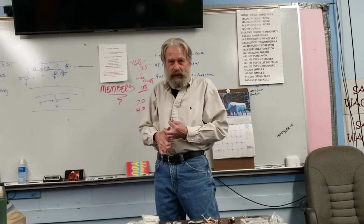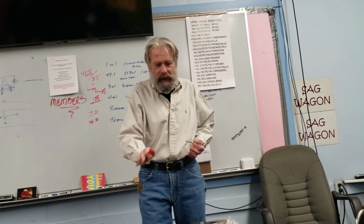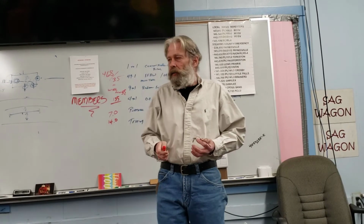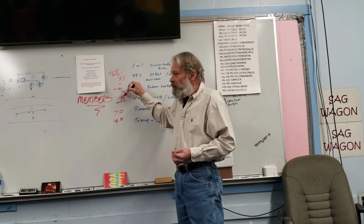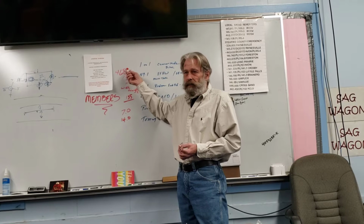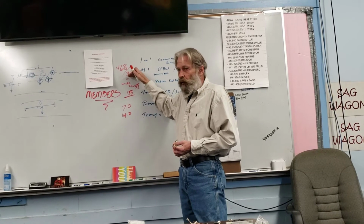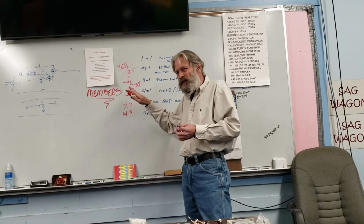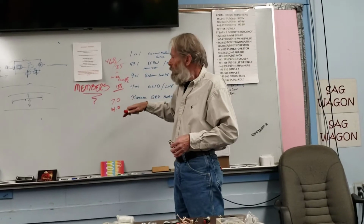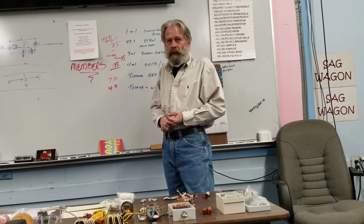So it's a multi-band antenna winding that allows you to pick wherever you want to operate. Now, sometimes you can't always do 135 feet. I have one at home that's half that length, so I don't get the lower bands, but it still works for 40, 20, and 10, but I haven't played on 10, I've got a different antenna that I use for that. But it works awesome on 40 and 20.